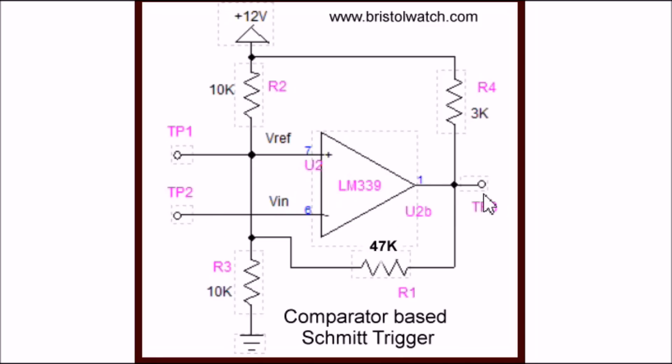Unlike the video you should have seen previously, I don't have the LED part of the circuit in this schematic. I also do not have the pot connected to the voltage-in, or pin 6 on the minus input. While the video showed an LM311, for our purposes the LM339 works the same way.